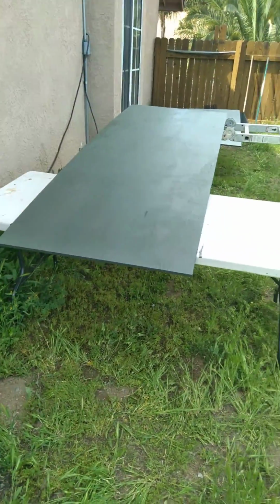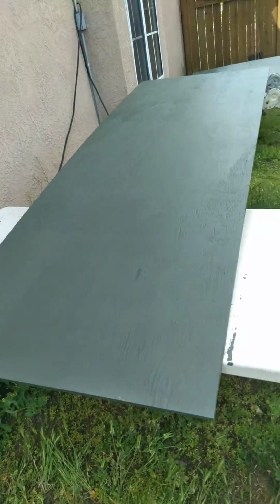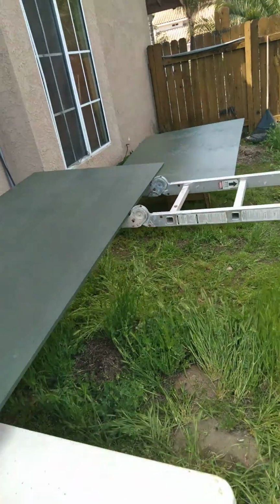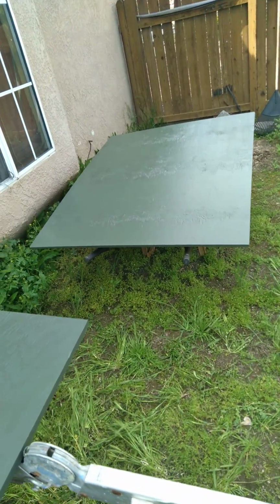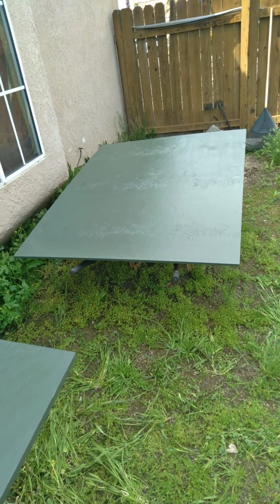See, I have to let this paint dry for at least an hour, they say, but it may take a little longer. I put a pretty liberal application on it, which is better. I mean, you don't want it too thick, but you want it thick enough to where you can seal it. See all these little crevices and all these little cracks in the fibers of the wood and the knots. You got to fill all that.